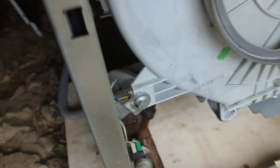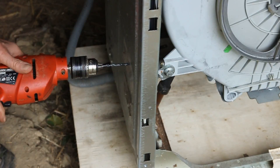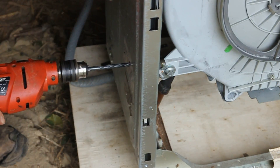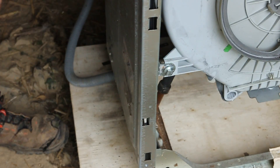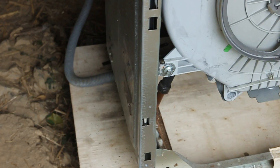I've just temporarily put the second bracket in and I've measured the whole position requirement. What I'll do now is drill it with the pilot hole and then open it up. Now I'll go through the 8mm drill. I've just temporarily put the bracket in place and I'll just mark through from the hole centre and go and drill that by holding the bracket in the vise.